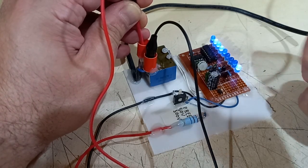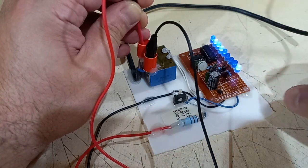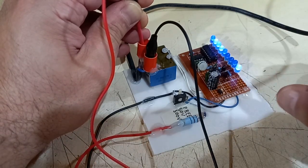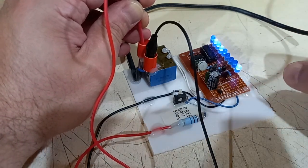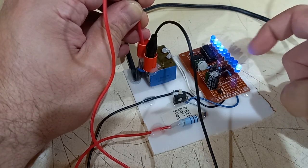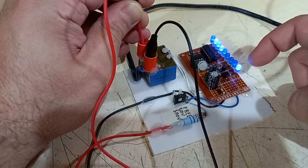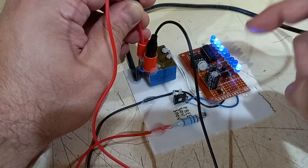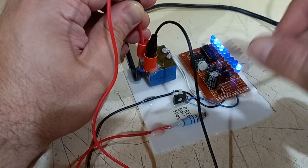This thing scans at 25 Hz, but due to the camera I see it flickering at 25 Hz — I can't see the scan, the LEDs look kind of steady. Sorry, I can't fix this. Anyway, the LEDs that are turned on show the positive half wave, the ones that are off show the negative half wave, and there's also another bit of a positive half wave because this thing visualizes more than a full wave — like 2.5 half waves.